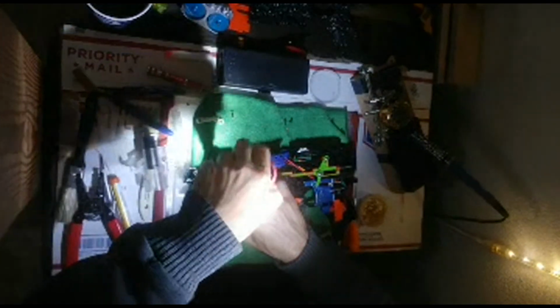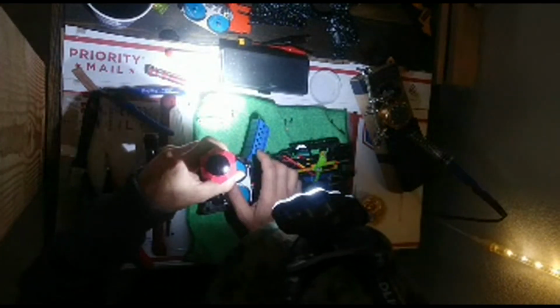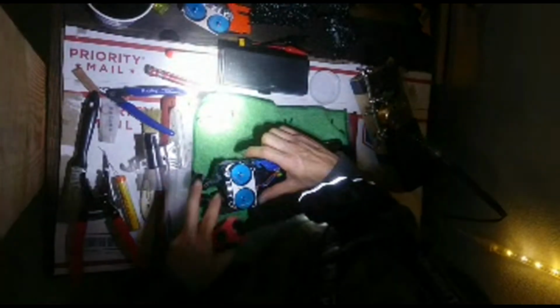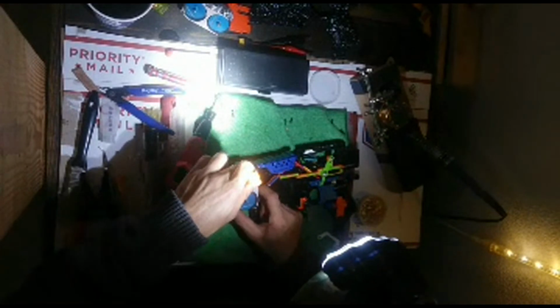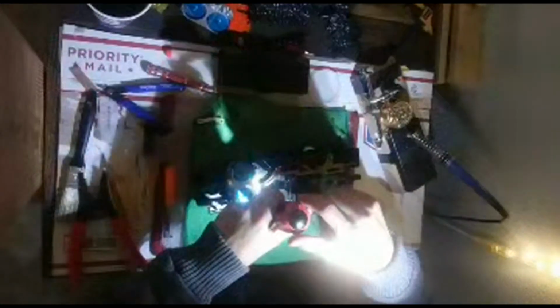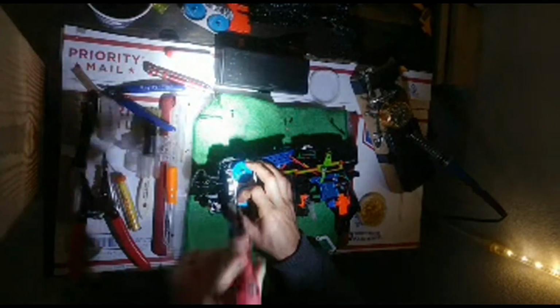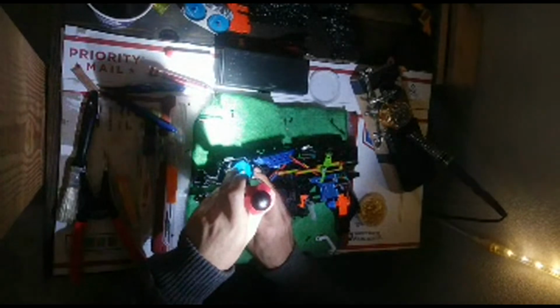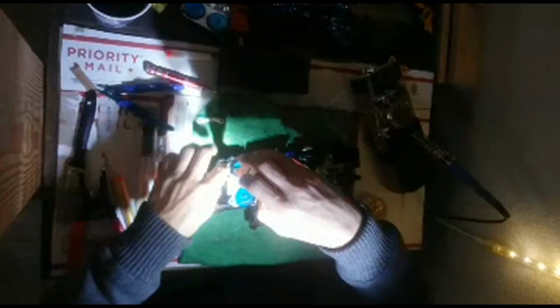Now see, this screw right here is giving me trouble for whatever reason, so I gotta be gentle with it, otherwise it'll cross thread. It's the only one too that doesn't want to go in. When I look through, I can see that the hole is just ever so not aligned, and if I kept wrenching on it, oh, it would not be good. That's how the stripping of threads happens. And you guys also have to take into consideration, as geekazoidal as it is, there's so much time and labor in this thing now with the paint and the upgraded electronics. If I were to screw up that one post, that's literally my little Michelangelo paint job and artwork completely ruined, because it would never be the same again.